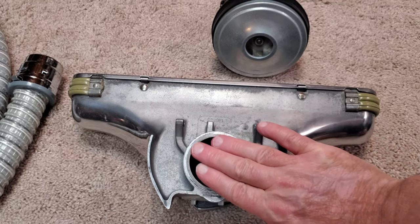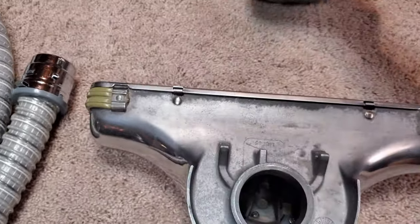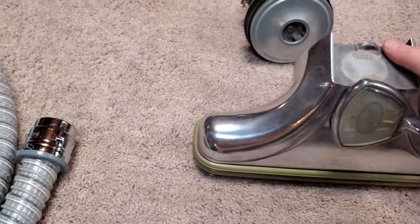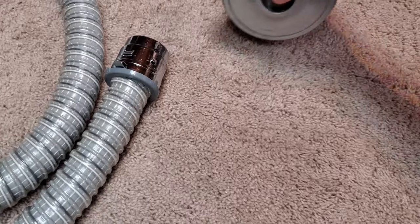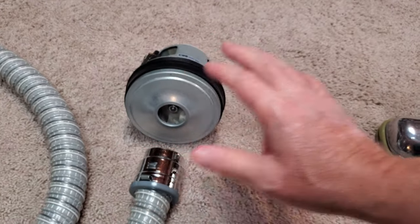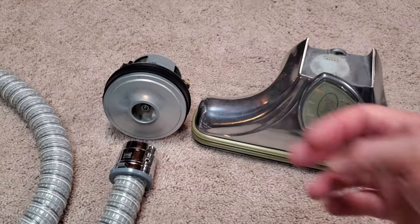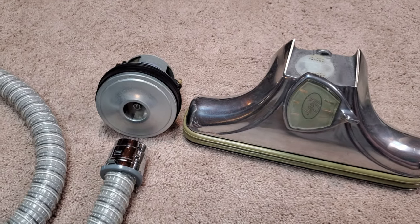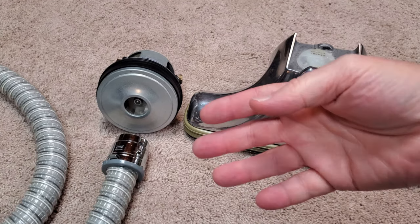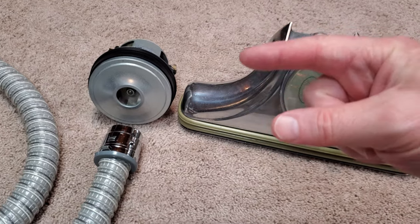The fan literally connects right up to the nozzle through a motor, and you get your cleaning power. If you're going to do the canister, obviously you'd do something like this hooking up a hose. But there's a problem with both of these designs: you don't really want all your dirt to always go through the motor. So you need something to interrupt the dirt — something that helps you separate the dirt from the air.